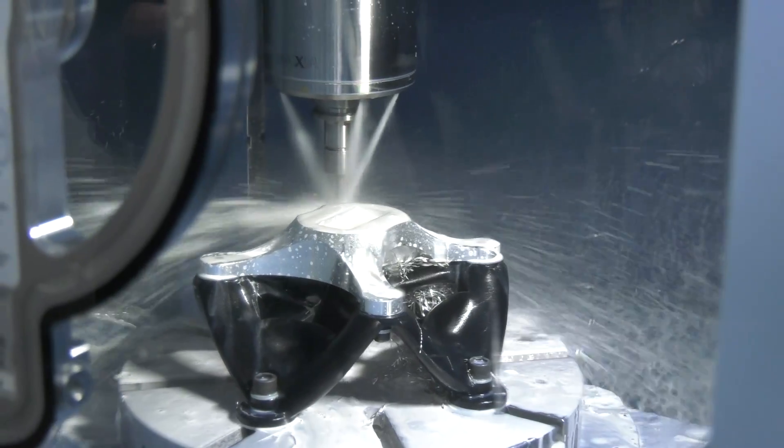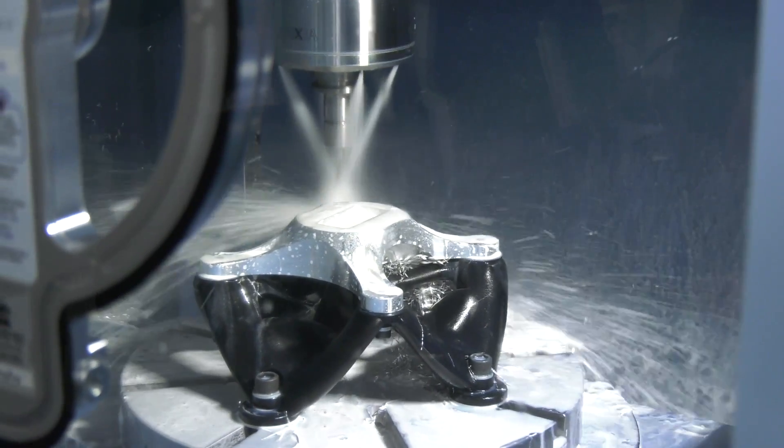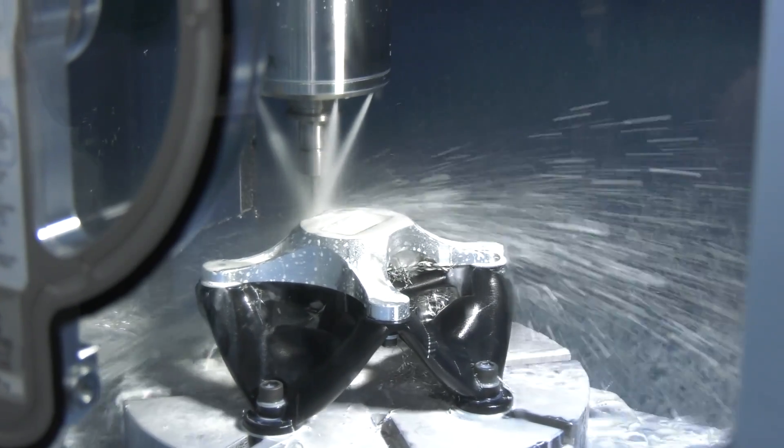Well, it's a bit of a new concept that we feel for the UK market. What we're actually doing is we're tying together the HP 3D printing machines with the 5-axis capabilities of the machine tool. The demo part on the machine today was actually printed overnight on our 3D printer, and we're now doing our 5-axis demonstration off that fixture.